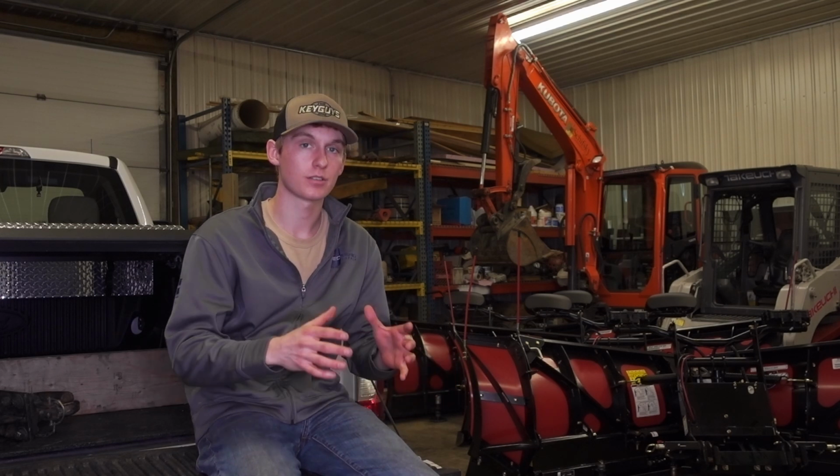So how we break it down is number of gallons, or gallons per 1,000 square feet. Now you can also do it per lane mile, they call it, but most people watching this aren't doing roads, so we're just going to go over the per 1,000 square feet for parking lots and things like that. So basically on a light to moderate snowfall, per 1,000 square feet, you're going to want to have 0.3 to 0.8 gallons. And you're going to have to do some testing on your own, see what works with the temperature and things like that.